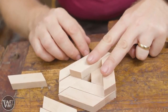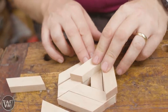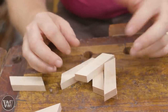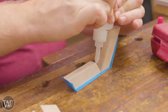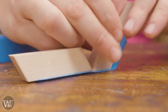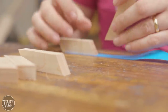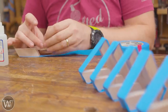So if these slide out this way, this pair slides out this way — that means it's going to expand. So these two need to be glued to these two. I need to glue them together as V's first. Because this is the first one and it's just a test, I'm going to glue these together with some superglue, and later I'll use some Titebond Quick and Thick. Superglue is great for this because if they break off, it's 30 seconds to glue them back on. I can glue these V's together individually with just some tape. They just need to be good enough — it's a weak bond and it will probably break. But we just need six of these V's put together.